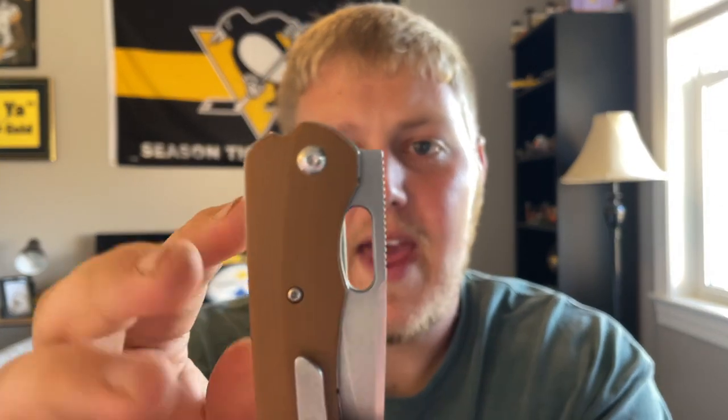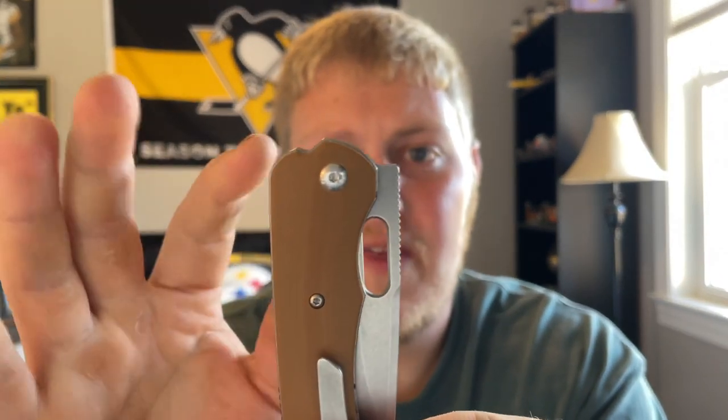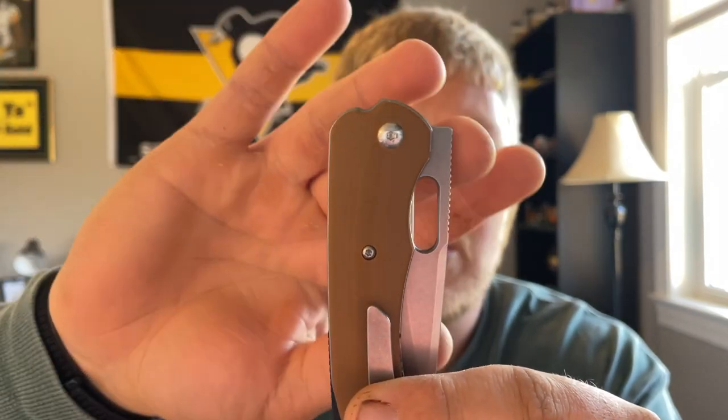The front flipper could be better. It kind of ends a little bit lower than I'd like — the tang should have come up a little higher, or rounded over a little bit more with some jimping. You really have to put the pressure right on the corner and it kind of bites into your thumb to pop it out. It's awkward, not the best design, because you don't have a whole lot of leverage to pop it off — you have to put a lot of force into your thumb.